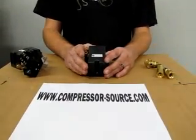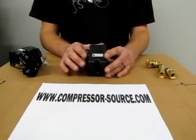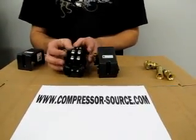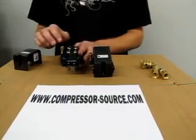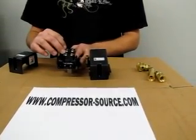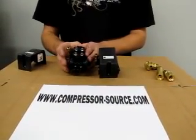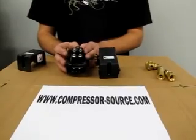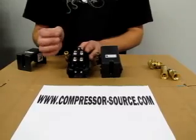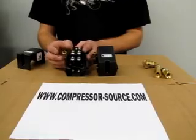If you have a magnetic starter on your compressor — usually found on industrial size air compressors — you will only have two wires going into your pressure switch instead of the normal four. One will go to motor and one will go to line. In that case all your pressure switch is doing is telling your starter when to turn it on and off. With a starter, the amperage of the switch does not matter since the main power is not going through the switch, so you can get any pressure switch that has the right pressure settings and the options you need.